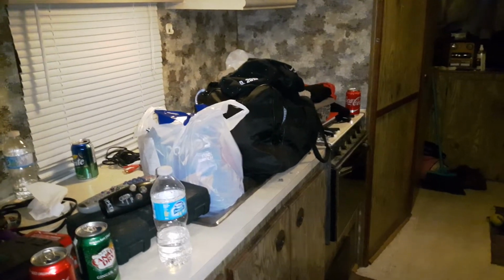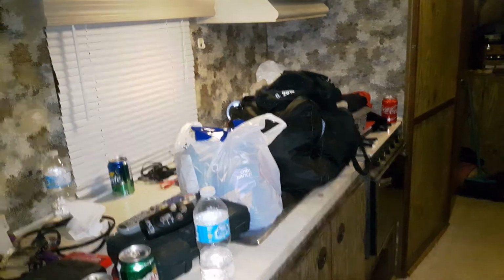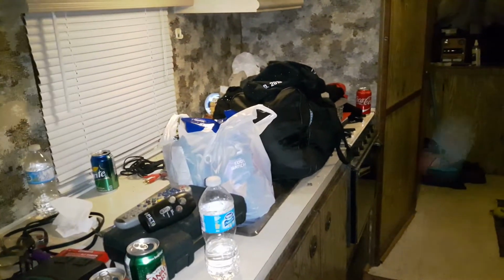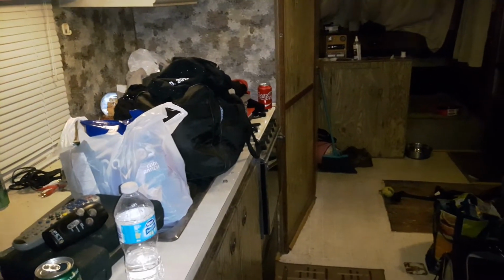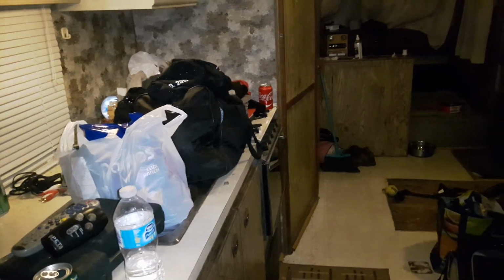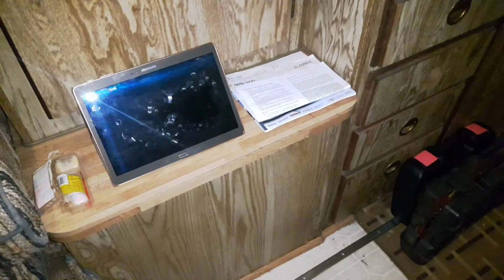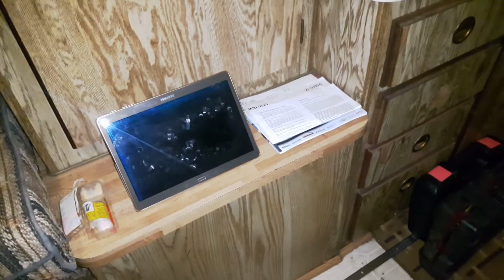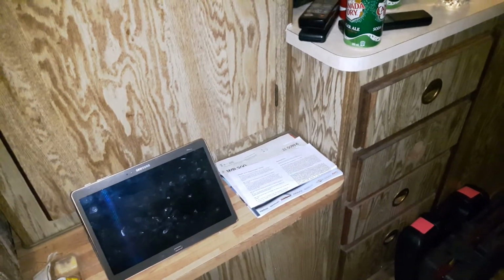So simply to get insurance, they capped off the line going to the hot water heater. They capped off the line going to the 3-way fridge. Really, with the fridge, they could have just disconnected the propane side and left the fridge. But the fridge may have had issues anyways. I don't really know. And then they removed the furnace and capped the propane line. But the power connections are still there. The thermostat is still here. So everything needed to put a furnace back in is still there.